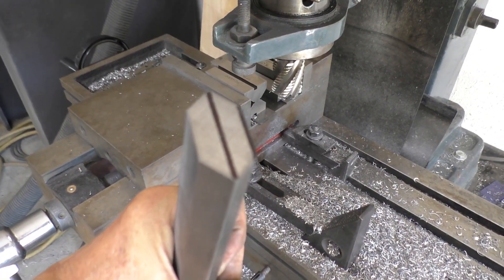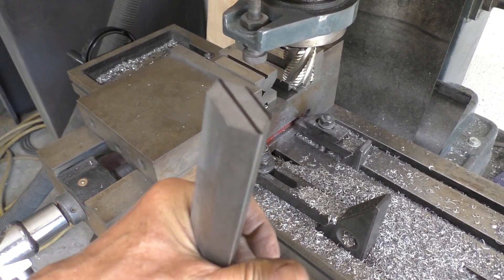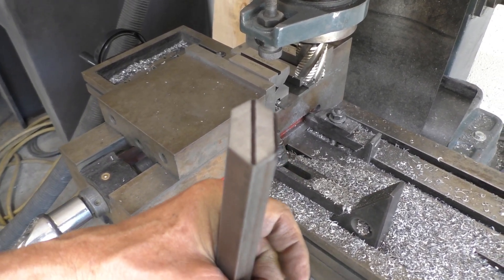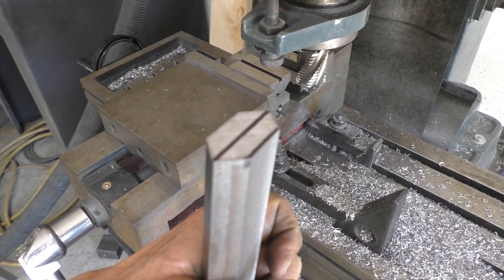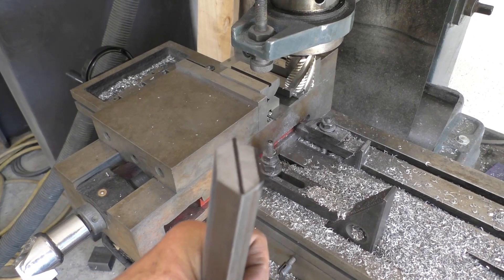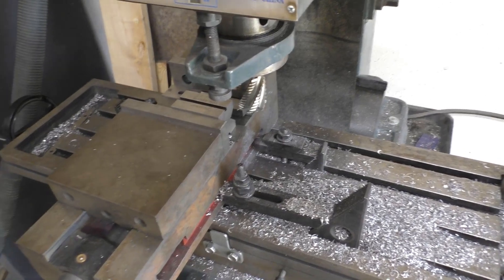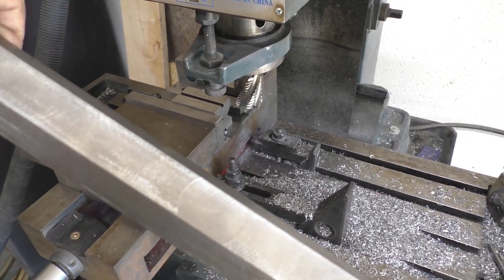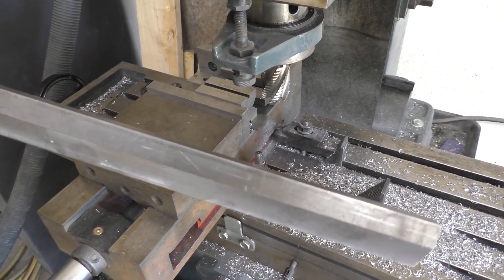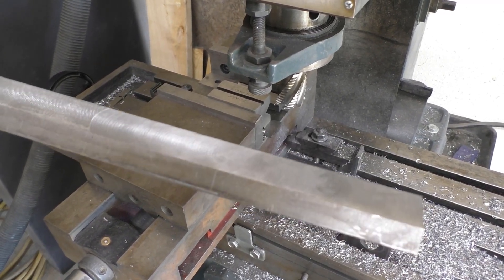That ended up being a little more than I thought. I ended up cutting off both sides because as I removed material from one side, the thing took on a definite curve shape. Unfortunately that's one of the problems with rolled metal — it has stress built into it, and as you start removing parts of it, it will pull one direction or another. You have to compensate for that. So I milled off the other side and it's back straight again, and if anything it's a little bit lighter.